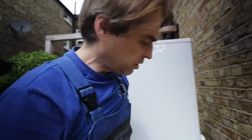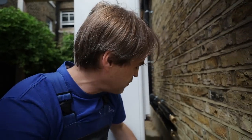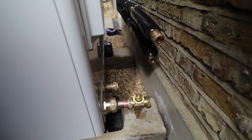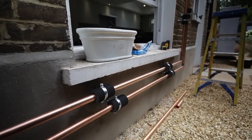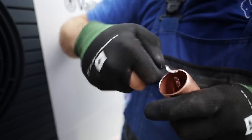Outside we've got the unit positioned in place with just a little bit of pipework to finish off. Two very short flexible hoses connect to the return. On the return I've got an antifreeze valve; on the flow I don't, because we don't need one there and they can fail — so we've got a 50% higher chance of success by only installing one. The primary pipework makes a long run: from the unit it drops down, goes across below the window, and up to the plant room. I only have two or three solder connections left and the primary pipework outside is finished; we can test it and then finish all the insulation.